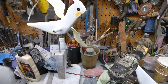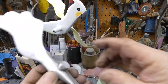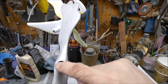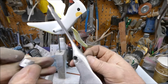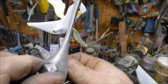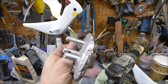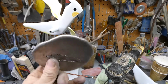And see, up next, I got a plug somewhere. So now I got that in there, I think you could put a little JB Weld inside there to hold these bearings in place, but I don't think they're really gonna move. So the next step is to plug it up, and I cast some plugs. They're not the best plugs. I think I'm gonna go buy some regular aluminum rod that's like 1/2 inch. Some other sizes too. I cast these myself.